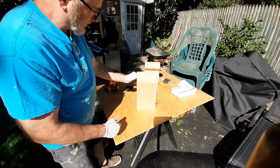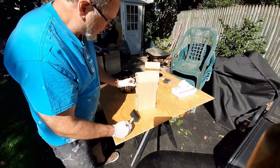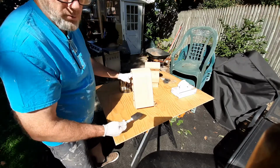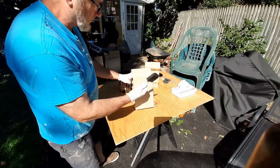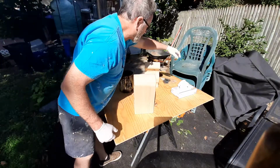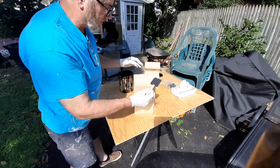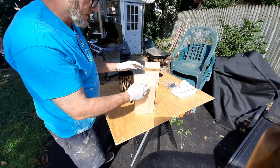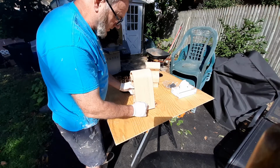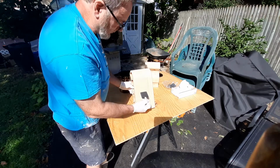Once you commit with the stain touching the wood, you want to follow through. So in other words, what can go wrong? Let's just say you stick your applicator into the stain, whether that's a rag or one of these sponge brushes. You drip. Believe it or not, that drip is going to become a semi-permanent part of your project, and that's not really what you're going for, I'm sure. So think about the way you're going to apply it in such a way that you're not going to drip onto your wood. Always keep a wet edge as well.